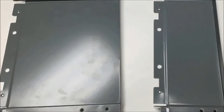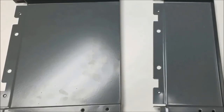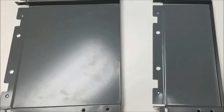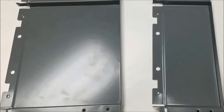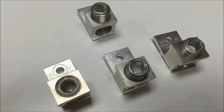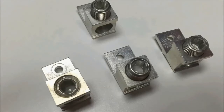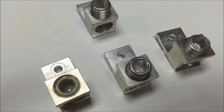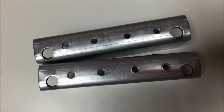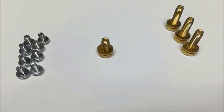For the low circuit count interiors, the longer cover on the left is going to be provided, and for the high circuit count interiors the shorter cover pictured on the right will be included in the kit. You'll receive four different lugs with your kit. One lug will be used as the neutral lug and the other three lugs will be used as the feed-through lugs. These lugs are all the same so it doesn't matter which lug you use where. Included in both kits are two rail extensions and two rail splices.